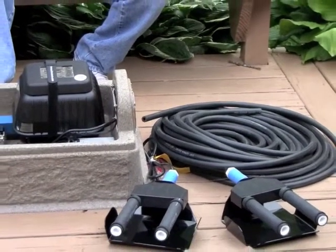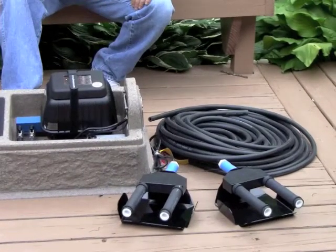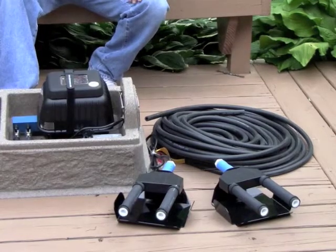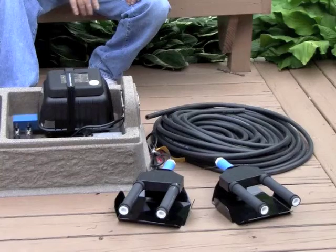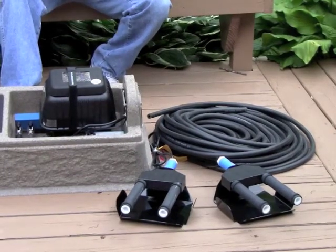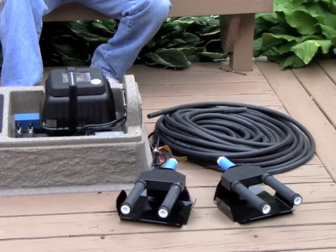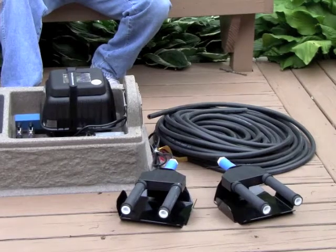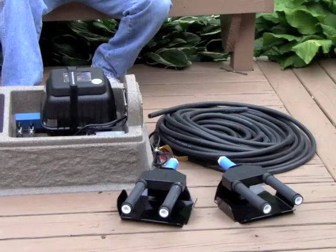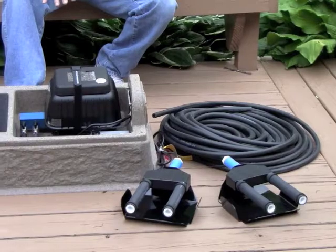What makes this system different is these two small diffusers up front — these are shallow water diffusers. They are on elevated plates with a weighted base, and they're elevated off the bottom. You'll see these two tubes coming out in front. You end up producing a little bit less air flow through each one, but by spreading them throughout the pond in various locations, you get better coverage and very good aeration in a shallower pond. This AM10SW will work in a quarter-acre pond up to about six to eight feet deep.